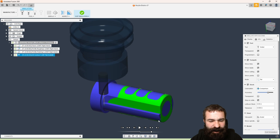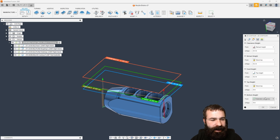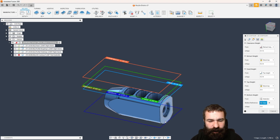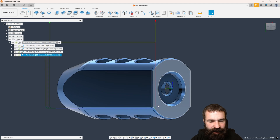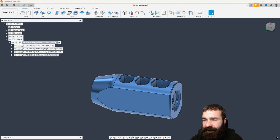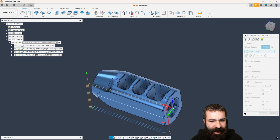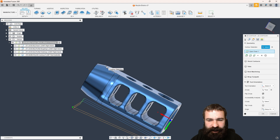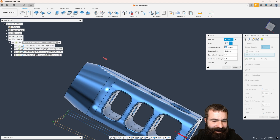However, we're not deep enough here, so we need to adjust that. We're going to go into that tool path, go to our Heights tab, say a selected edge that we want to work with, and I like to drop that past about 20 — so I'm saying negative 20. Just like that, we are now down below that flat edge and should be able to clean up that flat all in one shot. Now I'm going to extend this and add in the second edge at the same time. So we have one open chain, and I'm going to go ahead and add a second open chain.